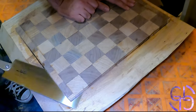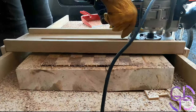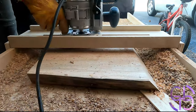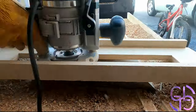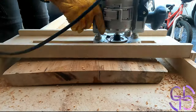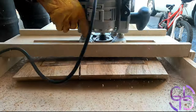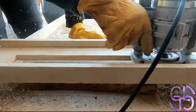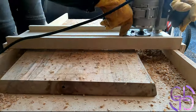Having a chessboard that's barely half an inch thick and cut in a wavy way isn't really optimal. And as you see, while he's cutting it there are really giant gaps between the board and the table itself — really, really depressing. This whole warping was really annoying me so I ended up using the router sled once again. I routed the whole thing until every single piece was one and a quarter of an inch thick. Losing three quarters of an inch of such wonderful wood is a huge morale breaker. But giving up is not something we ever do — every project started has to be finished. Even if it ends in failure, lessons can be derived and experience gained, which is priceless. As you can see, the crack here got even bigger compared to when we were hammering it in.